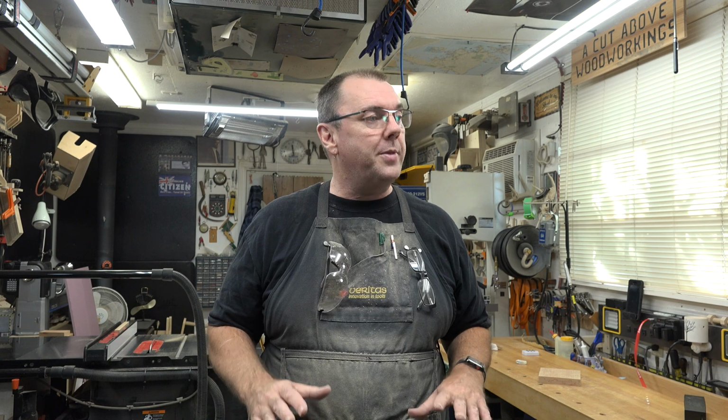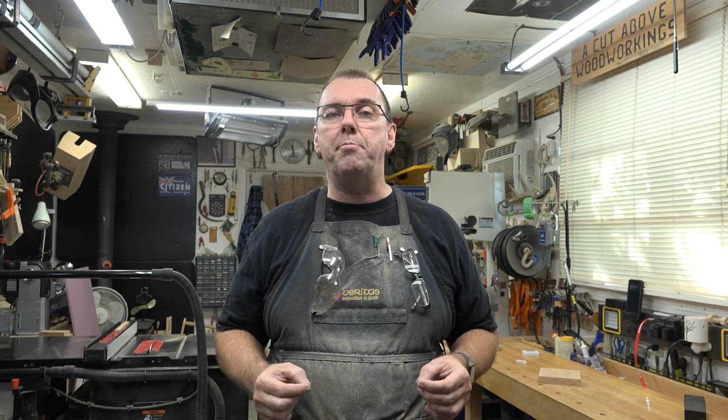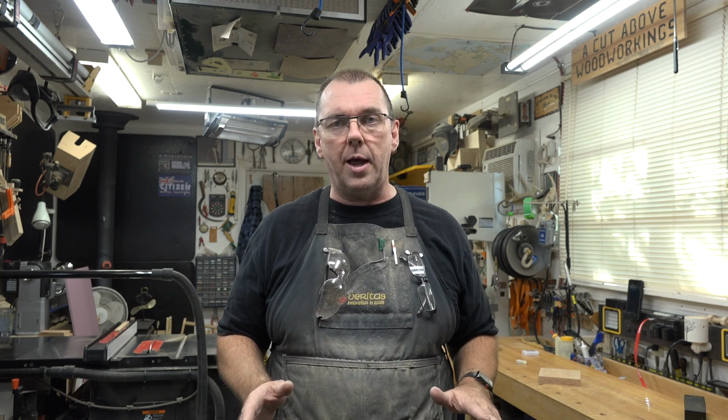So during the whole process up to this point in time, I have burned out 6 number 7 blades. That's not a big deal. You have to remember that blades are considered a consumable. And to hang on to a dull blade to get it to continue to cut for you to save on the price of the blade lessens the quality of your project. As well, you will have to be pushing a lot harder to get that stock to cut. Your blade will deflect. You're going to cause all kinds of problems. For the sake of 6 blades, who cares? They're a dime a dozen. They're sold in packs of 12. Use up what you have to make good cuts.